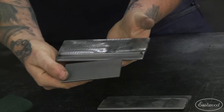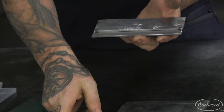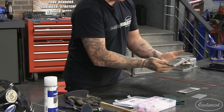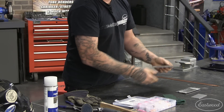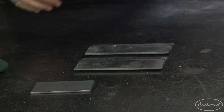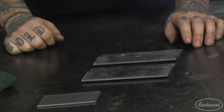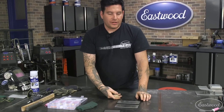I'll put it here so you can see the difference between the two pieces. This part here is just about ready to weld — I prepped it about an hour ago. One thing to keep in mind, and a mistake I see a lot of people make, is they'll clean a part pretty good, start working on it, leave for a couple days, come back and start welding. What you really need to do is clean the part again before you start TIG welding. Even if there's no visible surface rust, corrosion may have started or contaminants may have gotten on the metal and cause a dirty weld.